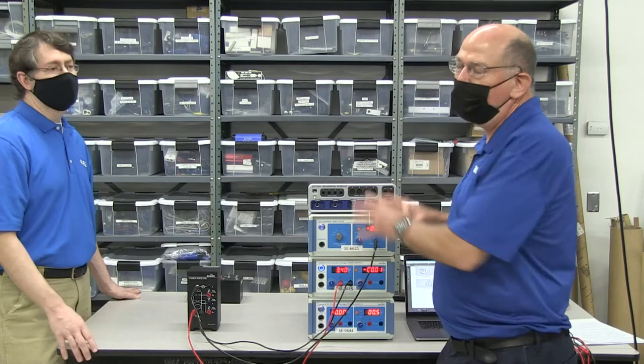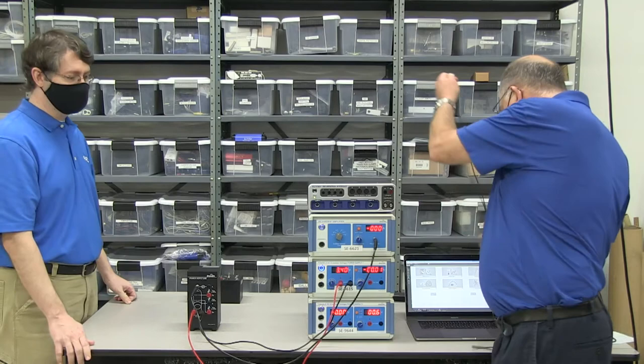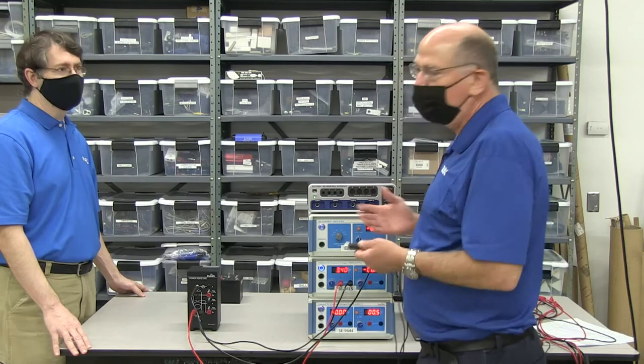If I push this button in, we're disconnected and we can calibrate so it reads zero. Once you calibrate it, you want to leave it alone and release that. If you're doing this experiment and you notice a student group isn't getting any currents, that's what I'd check first — if you have that button pressed in, it's not doing anything. You want positive zero. Now we want to hook up the rest and output data. You can just read the numbers off these if you aren't using a computer, but this experiment goes much easier with data captured by the computer.